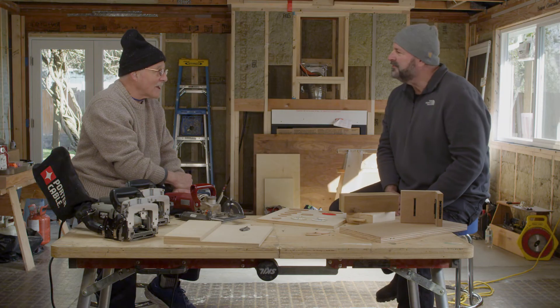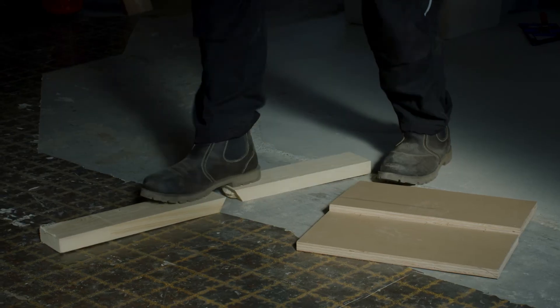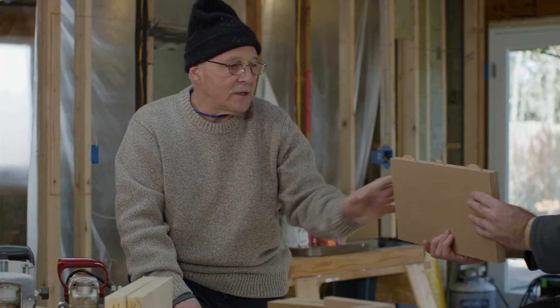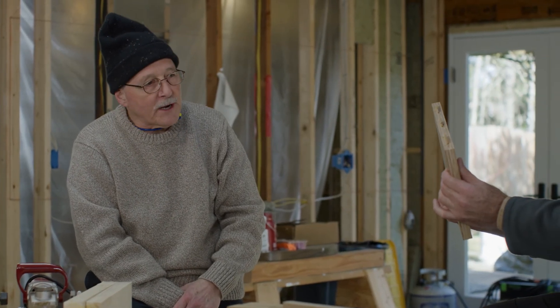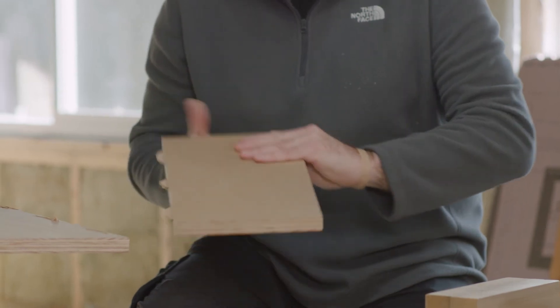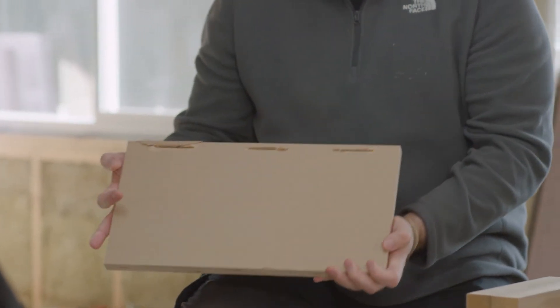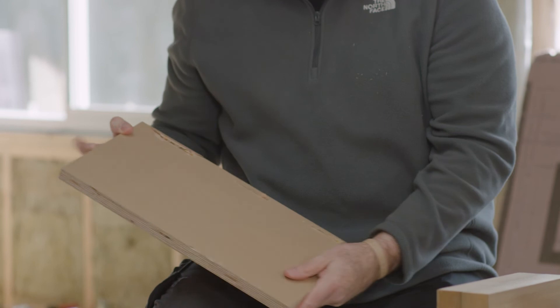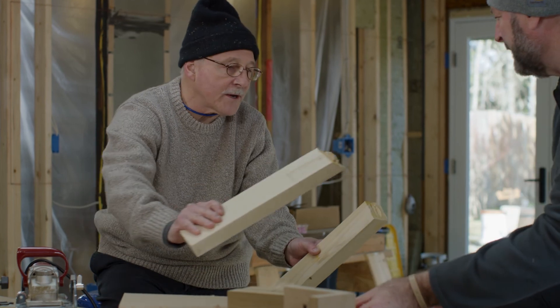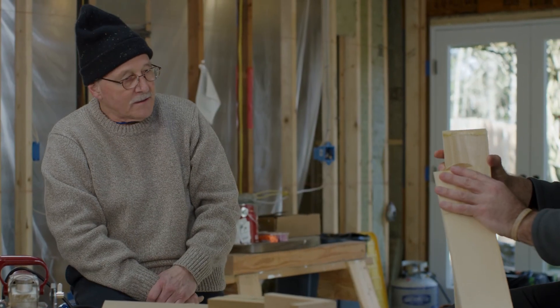I was going to suggest you might want to step on a couple of joints we made up last night. One thing that people are often surprised at — we only glued where the biscuits went in, and it's pretty rare that the biscuits break. This one broke a little bit on one side, but they tend to hang together and it's pretty strong. And doing it on solid wood, you can see we actually broke out the wood and the biscuits didn't break.